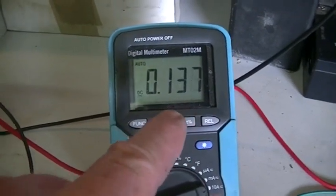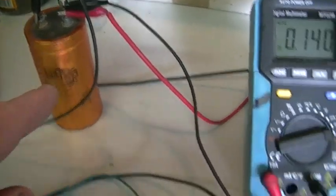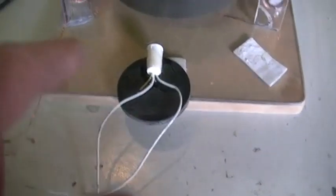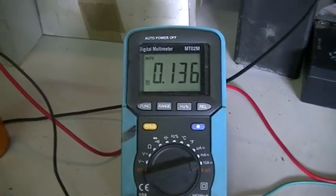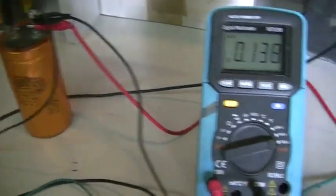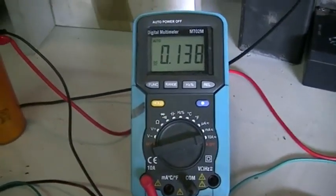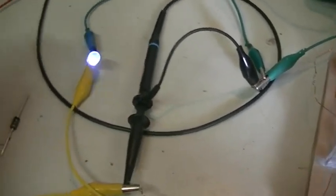We're coming from our power supply through the amp meter and into a large capacitor, then from that cap down through the reed switch and the system. This stabilizes our average current. It's pretty much the same as it was without that cap, which shows us our meter is doing a pretty good job at averaging the pulse current.